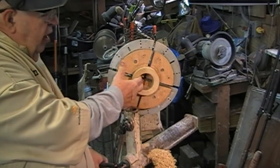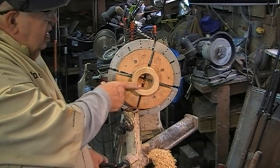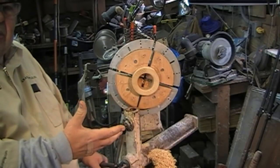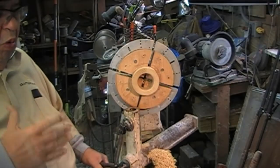I'm going to start at 80 grit, come all the way up to 320. I'm going to sand this face and this edge right here, these two. Then we'll move it to another jig to make the next two cuts. See how nice this is going along? And you actually have no worries.